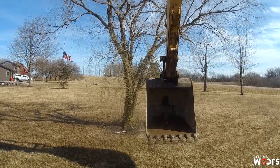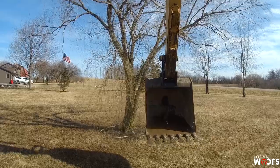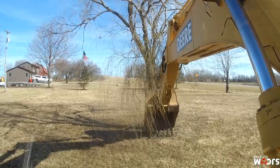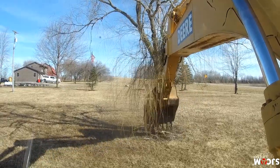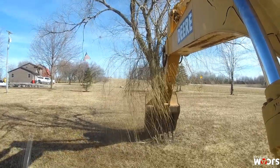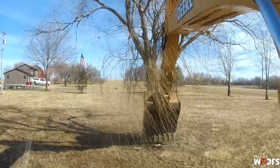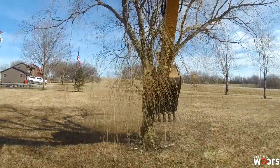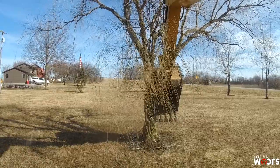That is super slimy. Fluid was building up in the crankcase of the travel motor and couldn't escape fast enough. So it's got to go somewhere, right? And so it blew one of the little seals out. The other thing's going to come right out.